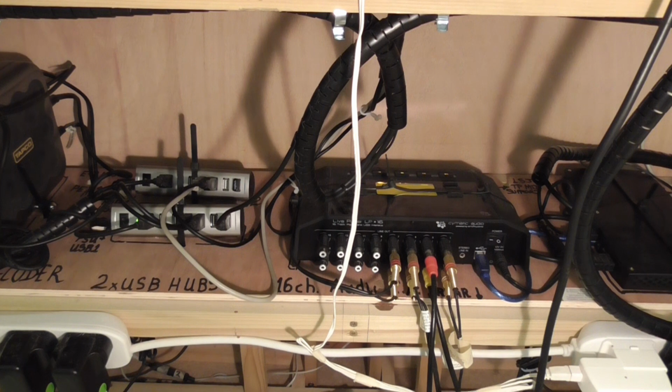It is, as I mentioned, a USB device. It works. It's very economically priced, but it does have the slight disadvantage that when the system is first turned on, it's very prone to creating a lot of crackles and pops from the loudspeakers as the system boots up. However, once that's happened, it seems to be fine. It's an ASIO compatible device, so it's got very, very minimal latency, and at the price it's very good.